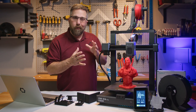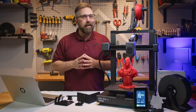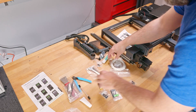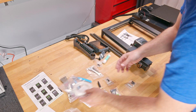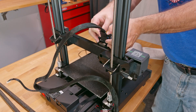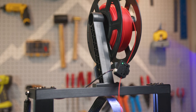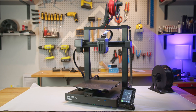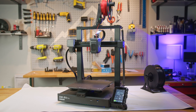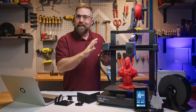So how does the SWX4 Pro measure up? Let's find out. The X4 Pro started off well — assembly was simple and straightforward: four bolts to attach the gantry, a few cables to connect, a couple of diagonal tie rods for added rigidity, install the control pad and spool holder, and the entire process took about 15 minutes, aided by a pretty good set of instructions.